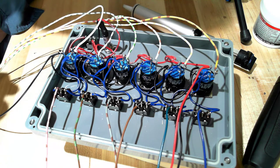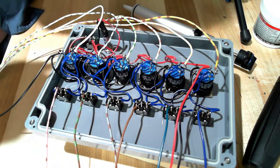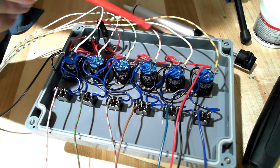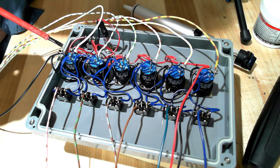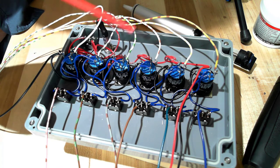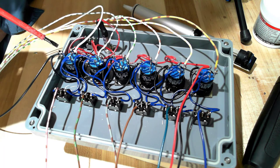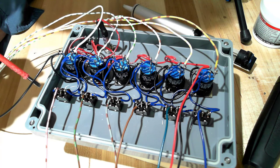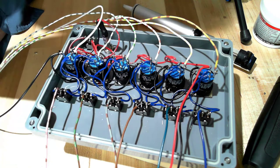Those will go to the output. So the output modules will feed 24 volts DC through the electronics of the output module. The voltage will come down through these 6 wires to these 6 LEDs and then out the negative side, this jumper to all of these push button lit switches and back to the power supply. So we have a black conductor going to the bottom of the box, the bottom half. We need a red one from here to go to the bottom, and that will complete all of the conductors that we needed